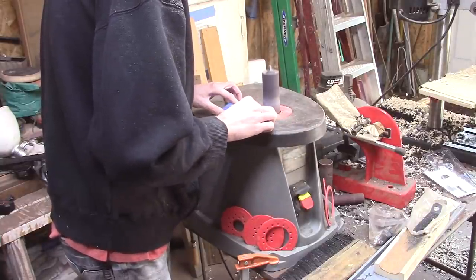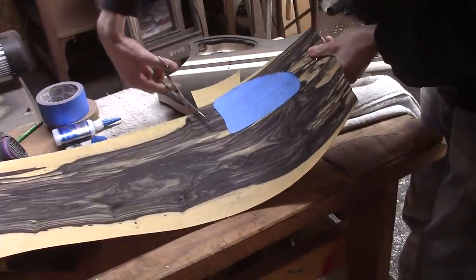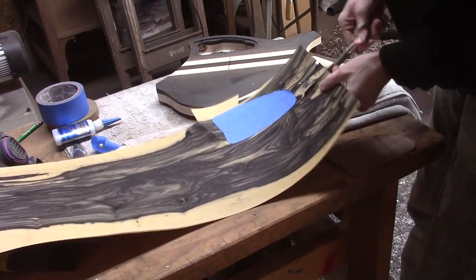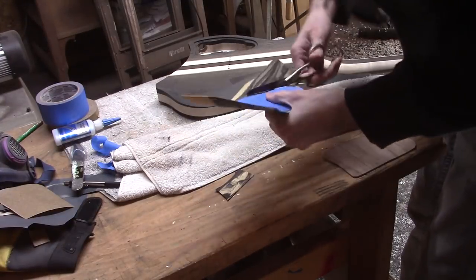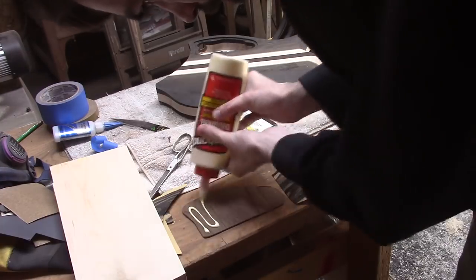So the way I made this took two pieces of walnut veneer, since I have tons of it. I glued those two pieces together with the grain in each piece going in perpendicular directions. That way the backplate will be less tempted to warp.